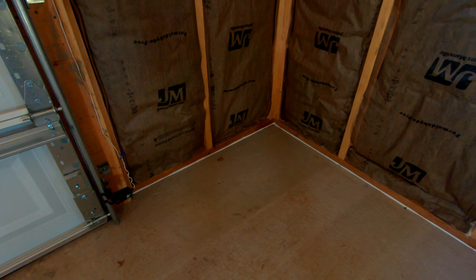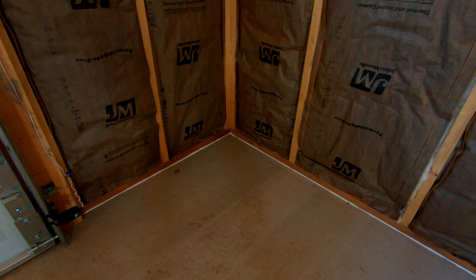This has been put off for a couple weeks now — it's going to be heavy and there's going to be a lot of tedium involved, but here we go. You will notice a fine white bead around the bottom sills of the walls. That's very simple, not necessary, but I decided to do it. We had an absolute dust storm a few weeks back and some dirt blew in between the sills and the concrete. I've caulked around the entire perimeter just to seal that out — it also keeps little tiny bugs out when it gets hot here. Is it necessary? No. Is it normal? Probably not. Let's put some walls up, it's time!